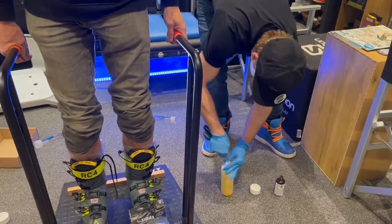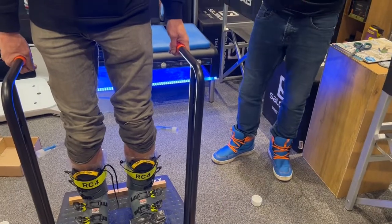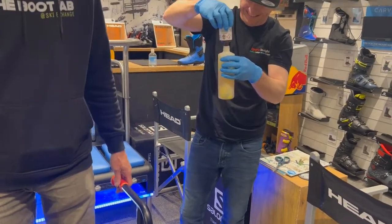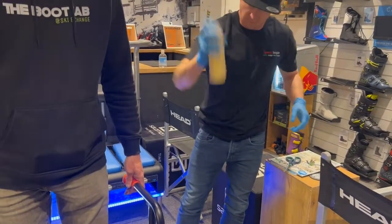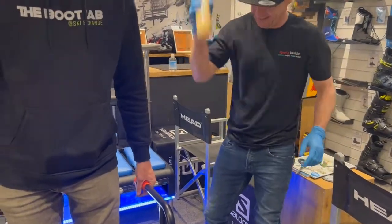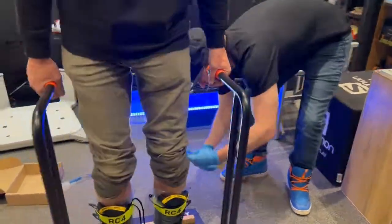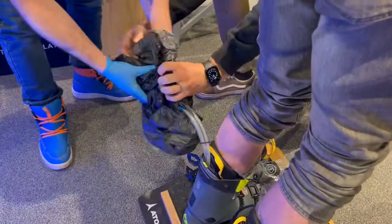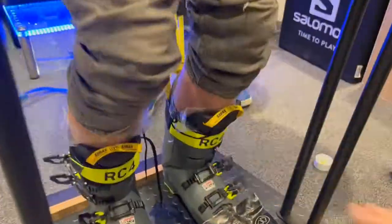Then we just need to make sure that the foam has come out of the front tubes. Once it's come out of the front tubes correctly, as we'll see in this video, we then close off the back tubes just by folding them over and make sure that the foam is no longer running through — that it's starting to harden off, and after about 30 seconds that should be the case. So we mix the two components together, attach it to the back tube of the liners and then let that foam slide inside.